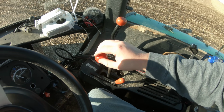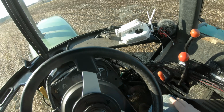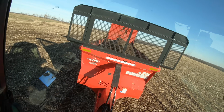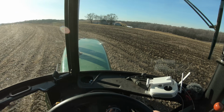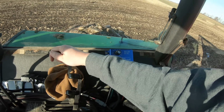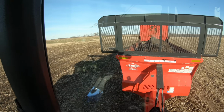I've been running about B2. I'm going to start off in B1. Speed the tractor up. The beaters are running full speed. Release the clutch. Start the web. And there you have it. You're now spreading manure.